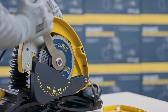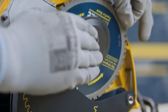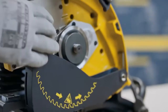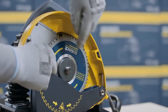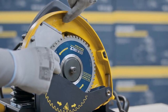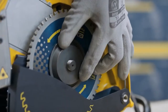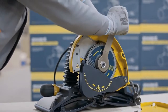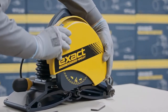Open the blade attachment. Before installing a new blade, make sure that both blade flanges are clean. When installing the new blade, pay attention to rotation direction. Ensure that the new blade goes right to the bottom of the back blade flange. Press the spindle lock button and tighten the blade securing nut. Reattach the blade guard cover and tighten the blade cover bolt.